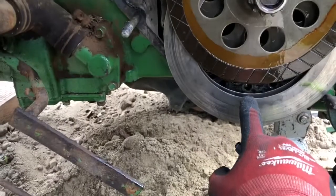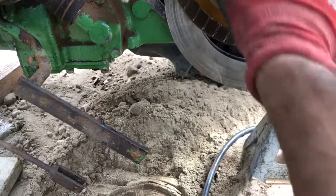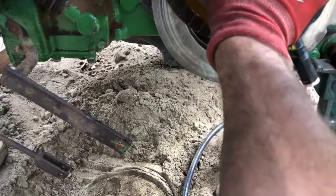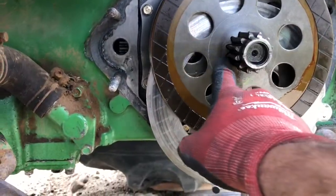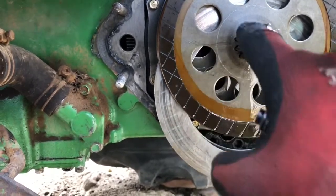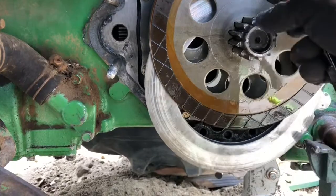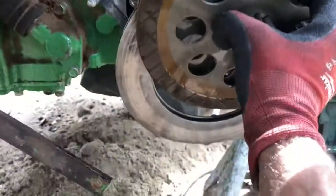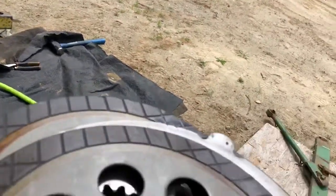Oh well. And these brakes are fried. You can see these rings right here. Something's been rubbing super bad. Here are your brake discs. And actually I can see that this thing was put together wrong, because the center of this brake disc is domed out. This curves out right here, which means it was cockeyed, and then the guy just torqued it down until it fit, which is all that did. I can try to show you here now. Take this guy off like this.